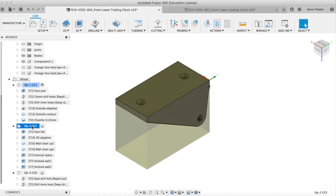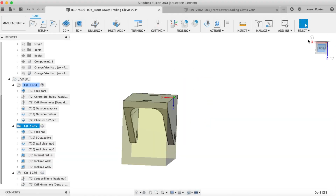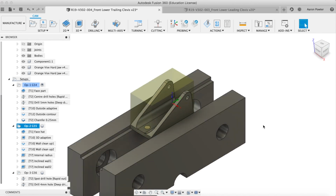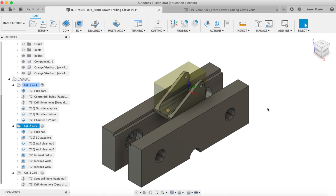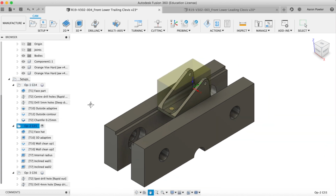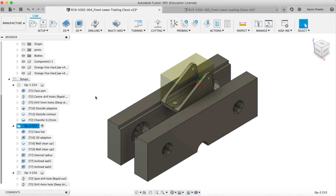Alrighty, so let's have a look at op two here now, and I'll just come back to my home position and I'll turn on my vise jaws. Now, originally when I did this toolpath, I did not simulate with vise jaws intact. And I forget who told me this. I can't remember if it was Al, Kevin or Tim, but one of them said, look, you must always simulate your 3D toolpath. And when I originally did this, I didn't have these vise jaws in situ,